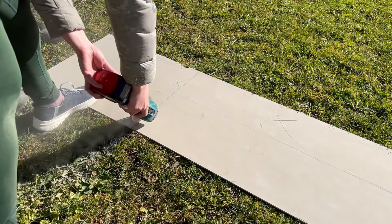I had to do the same thing on the other side of the room with the new frame that we had built where the new bath had been installed. After the new bath had been installed we then had to put the cement sheeting on, countersink the screws, and screw that all together. I went along and pre-drilled all of the holes and then got the screws and used the impact drill to put all those screws into the frame.